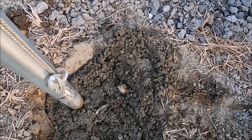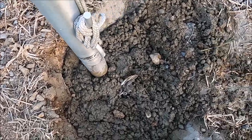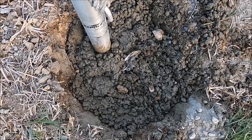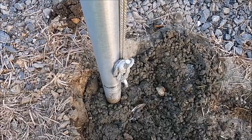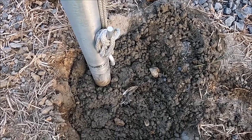You can see I spilled a little bit of concrete around the edge, but you want to make sure you don't get any dirt in your concrete. I have a little bit of debris on the top — I'm not that worried about that — but I definitely don't want it in the middle. This is just a pole anyway, but if you're setting posts for a porch or something like that, you definitely don't want any dirt in your concrete.